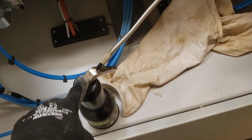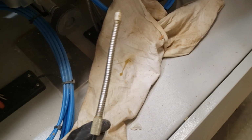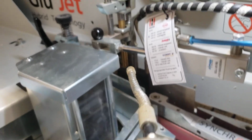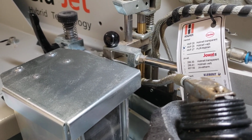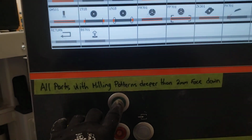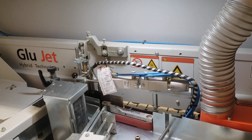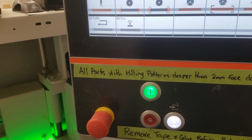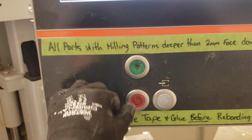But before I do that, usually I go down to this guy here and just make sure I prime the pump. So I have oil coming out. This is just regular engine oil, and it goes on our dowsing rod here, and you put just the tiniest little squeeze on there right against the rod, and then hit the green button, and so it'll bring the machine up, oiling the dowsing rod as it goes up. Once that's reached full height, then you can kill the machine again, hitting your red button.